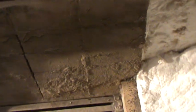Now, underneath the pan — you see here on the side — we took out most of the brick on the side and under the pan. Why do we do that? Because refractory insulation is more efficient than bricks. The bricks will keep the heat inside the brick, whereas the insulation will reflect the heat. So if you are reflecting the heat, you'll have more heat reflection under the pan. That's where you need the heat.